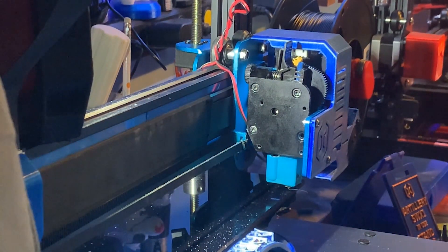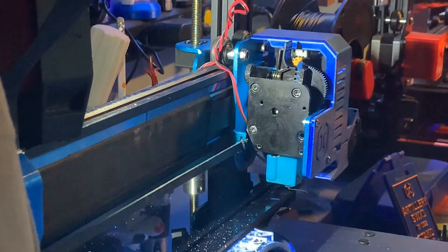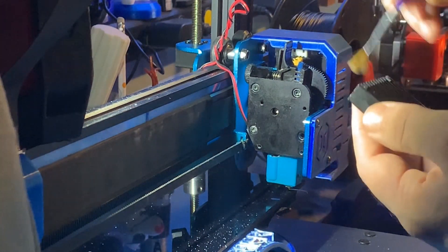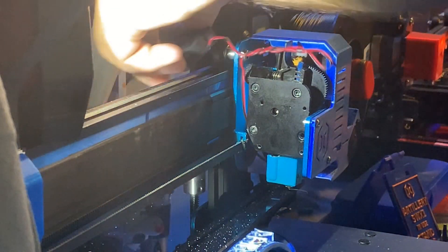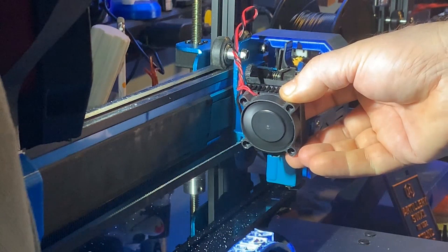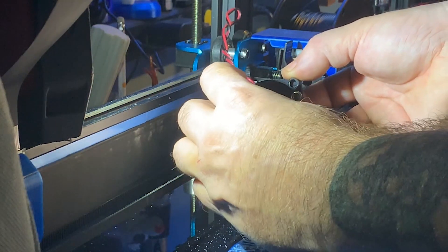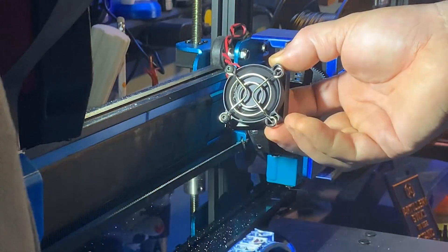Check your tension, make sure it's all good. Remember to put your heat sink and everything back in properly as well. I brushed out my fan and heat sink to get rid of all the excess filament that had built up — that's a good idea, might as well clean it out while you're in here. Remember that the flat non-grated portion goes back towards the flat side; you want the fins where the fan is at.